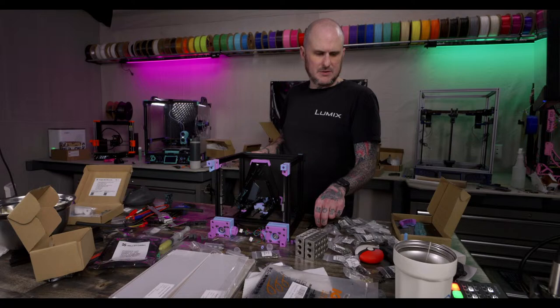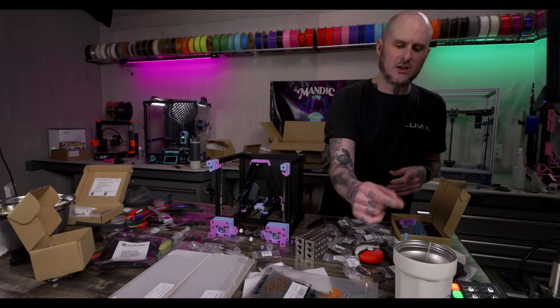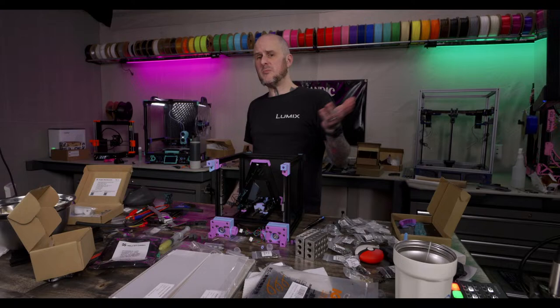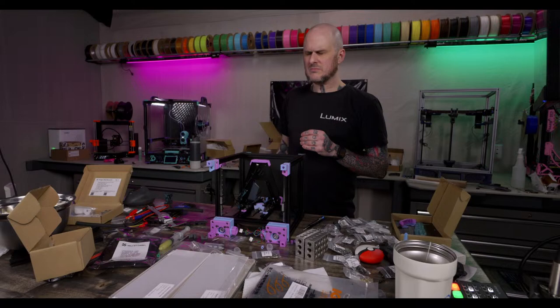Like my 2.4, if I start a print on that at 105 degrees Celsius bed temperature, 245 on the hot end, printing away, I have found that if I turn the Nevermore on to full blast, in a few minutes it will raise my chamber temperature by anywhere between 2 to 5 degrees Celsius. I think I even went higher than that before. I'm absolutely achieving significantly higher chamber temperatures with the filter circulating air in the chamber than I was without it.